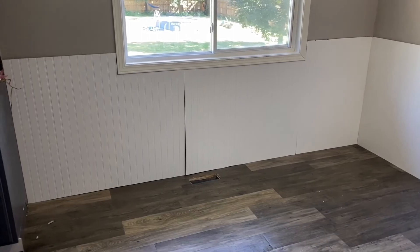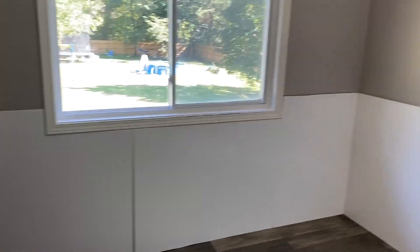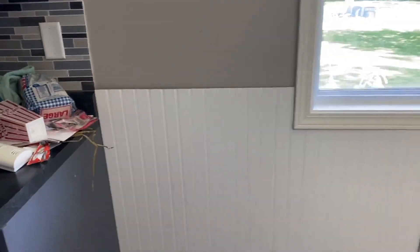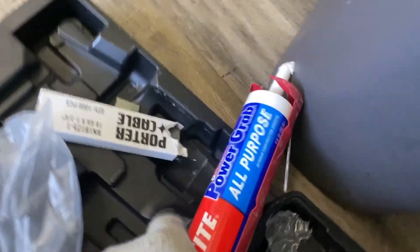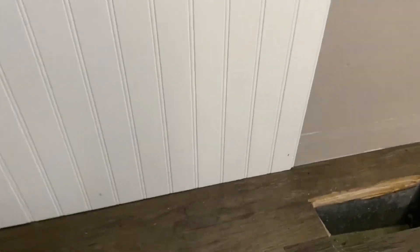I got my sections cut out and pre-cut already. I'm going to start gluing and nailing. I'll be nailing just to hold the panels in place — maybe a nail head at the bottom. I'll apply some glue using Power Grab. Just got some nails at the top to hold in place, some at the bottom. That Power Grab, once it creates a suction against the panel on the wall, it's not going anywhere.